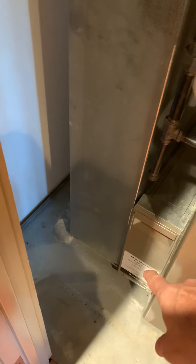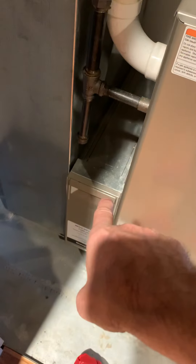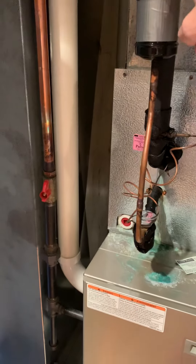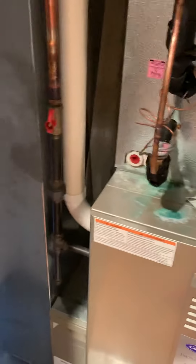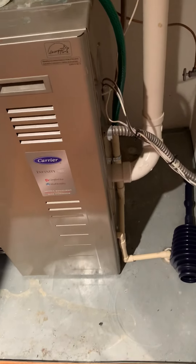We're doing a new humidifier return drop, replacing from here down. This one is 10 by 20, 10 and a half by 24, so it could probably stay. We'll get a new filter in here, flush the line set even though it's R-410A, and modify the gas piping, flue piping, and drain going down in here.